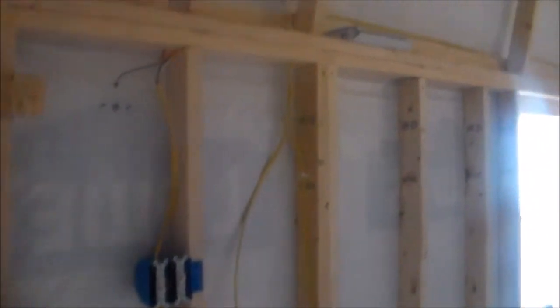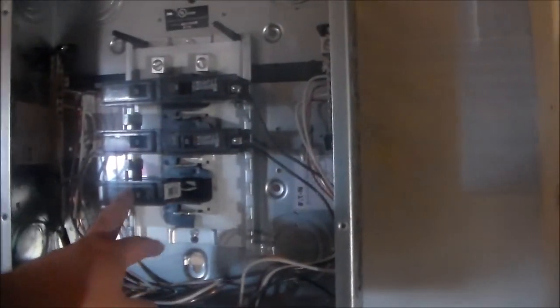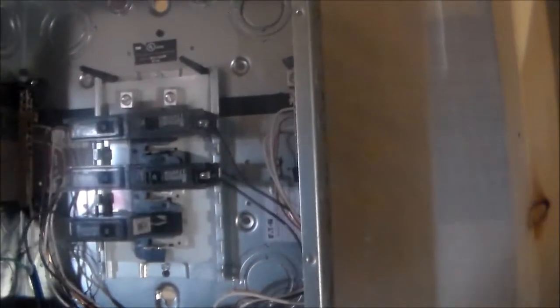If you all have any questions or suggestions — I know everything's really loose. I've got a lot of wires I need to finish tacking up; I ran out of clips. I've got to finish tacking everything up. I need to get a ground rod for the breaker box. Right now I just temporarily jerry-rigged it with a suicide cord into one breaker so I could have power — that's why only one leg of the box is powered and I skipped every other breaker.